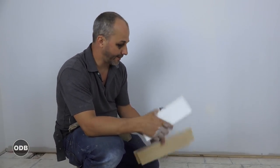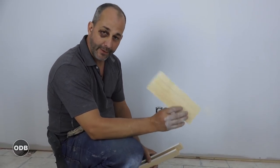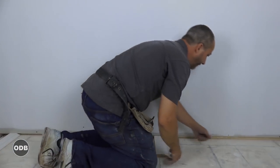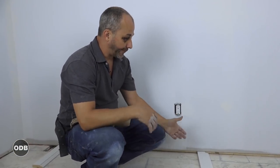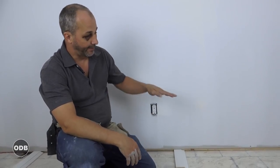I like to miter my corners and still rely on some caulking, but I like to glue my wood corners together because of expansion and contraction. I'm going to show you a couple of tips when you're working with thick wood, because wood has a tendency to not be straight. What I do is take some scrap and throw it on the wall right away — that's what I'm building on. Whenever I'm working with wood like this I want it the same thickness off the floor. I'm putting the flooring down and I'll also have a base shoe, so I don't have to worry about the gap. That gap is really convenient — it has a little bit of give for the bend in the wood and it's still going to look amazing.